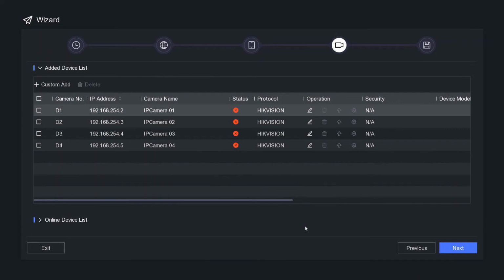Okay, so it's our hard drive. Okay, guys, so this is a used hard drive, so it might look a little bit different here. What you have to do is select your hard drive, click on initialize or INIT, it'll be something like that, go OK, and it's going to start initializing the hard drive.